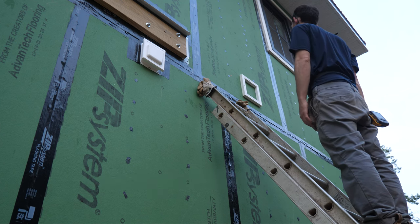Here's one of the frames we made for the garage lighting block. It's a pretty large frame and had plenty of room for a four-inch junction box to sit right in there. We sealed it up with liquid flash where the wire comes through and coated the whole back of the box so it bonds really well to the ZIP sheathing — that thing is not going anywhere. We put some metal head flashing above the mount block, and then before mounting the fixture the last step is to come back with a half-inch PVC sheet and go over the whole top, overlapping edges about three-quarters to one inch to create a hidden edge for all the siding that's cut. These frames are made out of three-quarter PVC and shimmed out a quarter inch so there's a gap behind the block to integrate with the rain screen, which is a quarter inch thick.